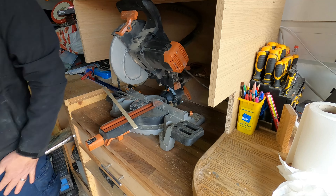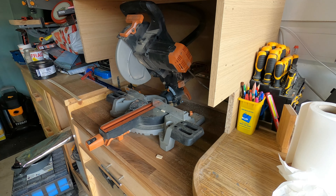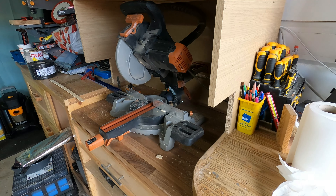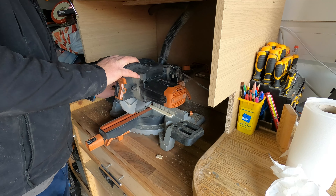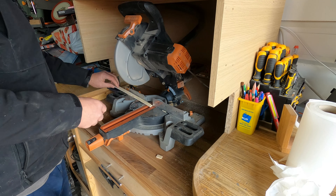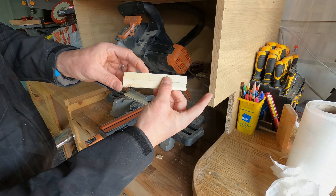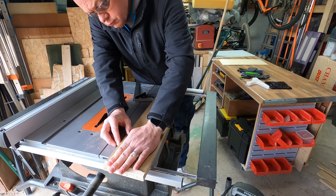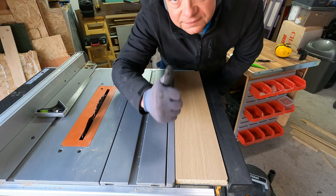With this project I was trying to make everything as good quality as I can. Once I had the piece of wood the correct way round, I took the end off and ran it back through the mitre saw to get it exactly the right width — I think it was 13.2mm. I used super glue to stick them down, put them in clamps, and they came out rock solid.